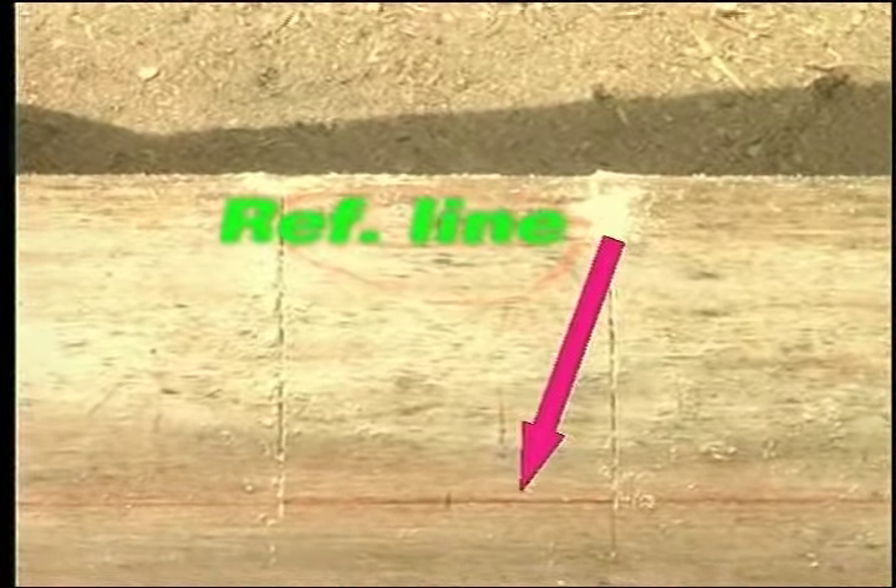You may wish to cut dado grooves on the flat side to make a better house for the sheathing when the structure is finished. The post for the purlins will be treated in the same way, but instead of the apex of the log, you can dimension your height from the intersection of the center line and the slope line. The simple mortises on the top of the cap log can be cut on the building. Unless there are unusual circumstances, these three mortises will be positioned on the center line at the middle and quarter measurements along the cap log, much like the tie beam for a truss.